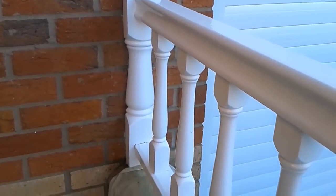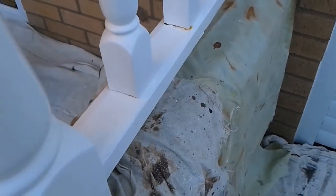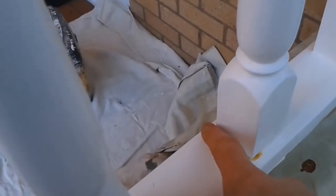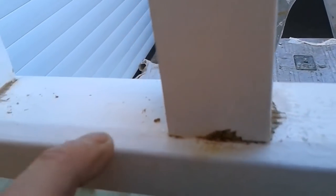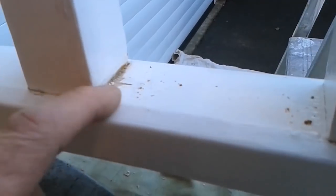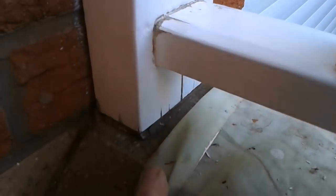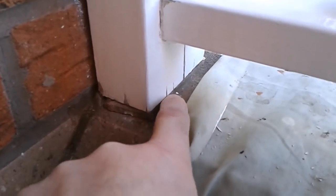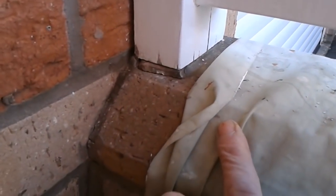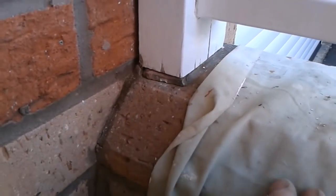A little bit of woodwork once doing outside on this porch support. A lot of cracking out. So that's the scraping back done. Where it was coming off is mainly around where the joints are. But down the bottom of the posts, the cement is sitting. That's been finished wrong. Moisture is creeping up the bottom of the posts.